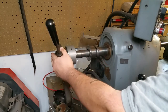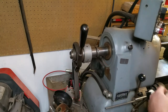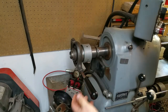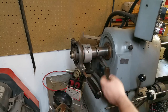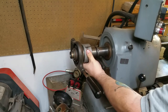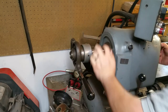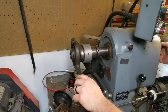The reason why this is on there will be obvious in a minute. The collet closer swings out of the way — so that's locked, and that's free. This is a lock right here that locks into that indexing ring so this can't turn. What you do is you loosen that, and you spin this to screw it down on the collet. This is how you preset your collet — this is how you set the clearance on the collet for the draw. So this is locked right here.